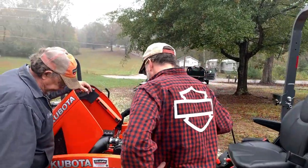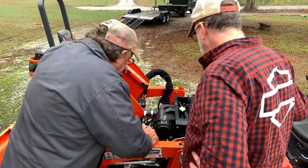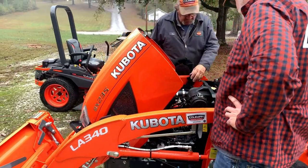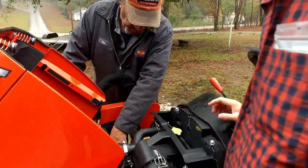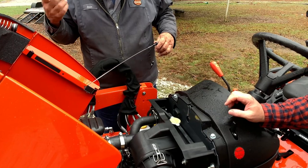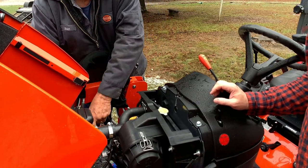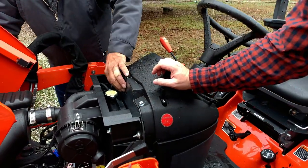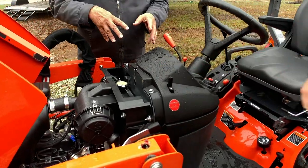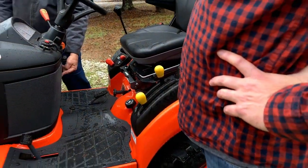That's your whole big engine. You got a fuel filter here. That's basically it. Over on this side is your antifreeze overflow. Dipstick's right here. This one is like your mobile home. Diesel or CJ4 oil or better. 15W40, whatever. Matter of fact, you can probably use the same stuff you use in the mobile home. Fill it here. What I like, it's got a screen to clean off if you're doing a lot of stuff. And the fan's reversed, so all the air is pulled in from this way. Unscrew this knob, slide this out, and your battery's in here.